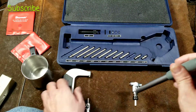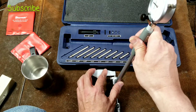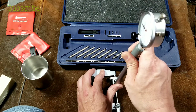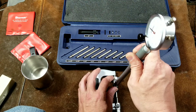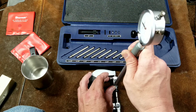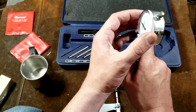The deal to set these up is actually not so bad. You just need to get the micrometer on the surface, put the spring-loaded anvil in first, then get the other anvil in. The only tricky part is it's got to be vertical — that's where you have the space. And then you just have to wobble it around until the needle gets to its highest point, because then you know that you're absolutely at the center.